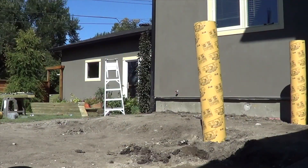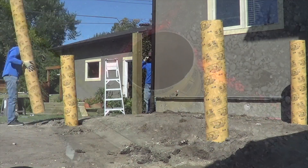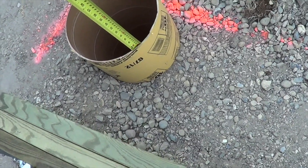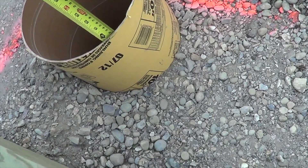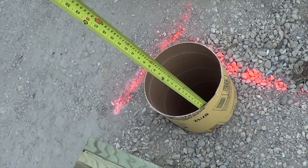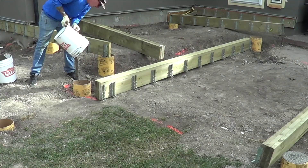My brother is the best — he was always there for me on deck pile days. Now all these piles are backfilled and depth is verified, it's time to pour concrete. I've elevated all the forms an inch and a half below the deck structure, so I won't be installing saddles on these piles. We poured these all by hand using pails and a concrete company that lets you hook a trailer cart full of concrete to your truck and deliver to your own site. This saves a lot of mixing bags — this would have been between 70 and 75 bags of concrete.